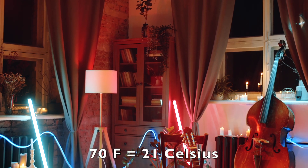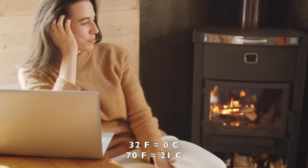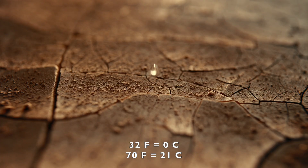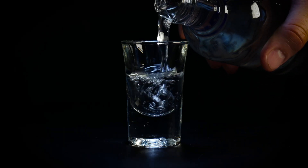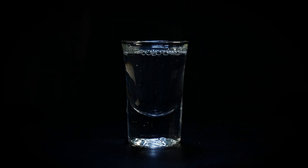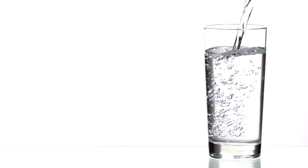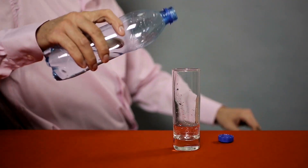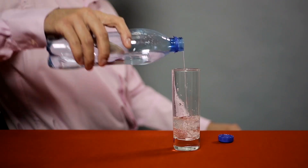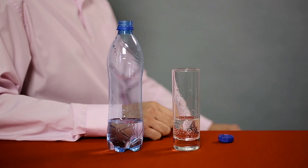Let's say the air inside your home is 70 degrees Fahrenheit. If 32-degree outdoor air with 100% RH leaks into your home and warms up to 70 degrees, its RH would then be 20%. Sounds pretty dry, right? This is because 32-degree air can only hold a small amount of water vapor — around 22 grains per pound. So its RH is 100% when it holds 22 grains per pound of water vapor. In contrast, 70-degree air can hold far more water vapor, around 110 grains per pound. So when air with 22 grains per pound warms up to 70 degrees, it becomes apparent that it doesn't actually contain very much moisture at all. 22 grains per pound of water only fills 20% of the holding capacity of 70-degree air.